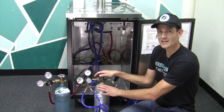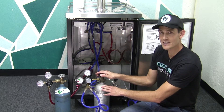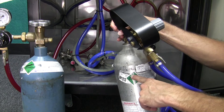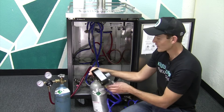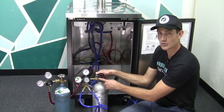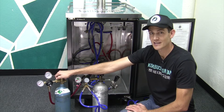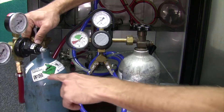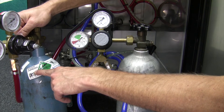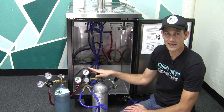With this CO2 gas cylinder, or carbon dioxide, a couple ways you can tell that it's CO2: one, it should have a label on it, and on that label it'll tell you what the gas is. The other way is the threads on a CO2 gas cylinder are on the outside. On a nitrogen gas cylinder it'll tell you that it's nitrogen on the label, and if it does not have a label, the threading is on the inside. I'll show you what those are when we take these apart.